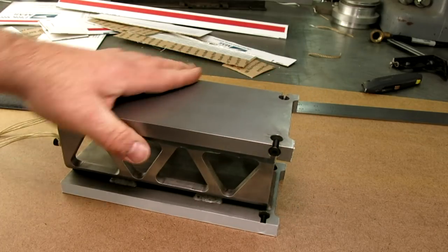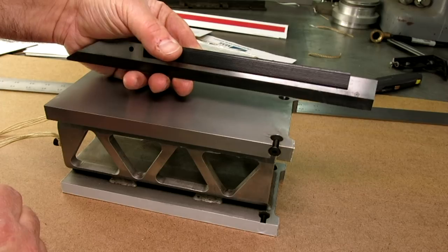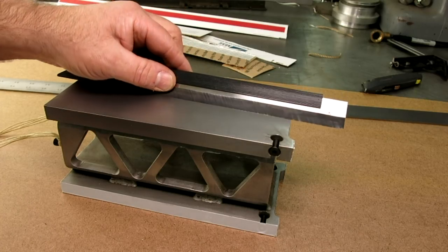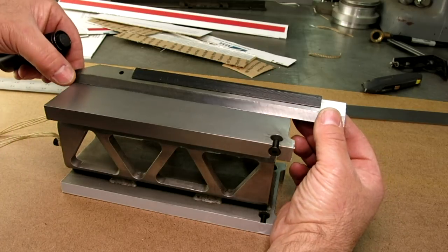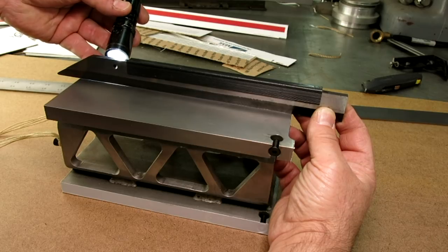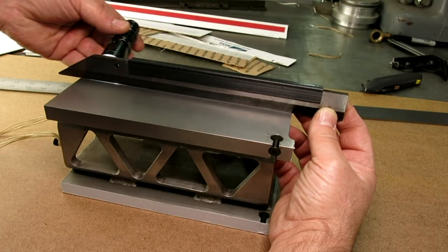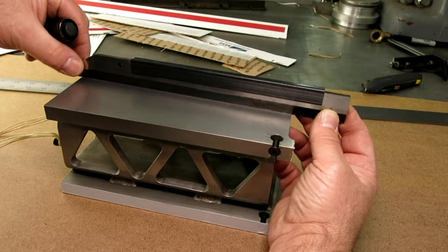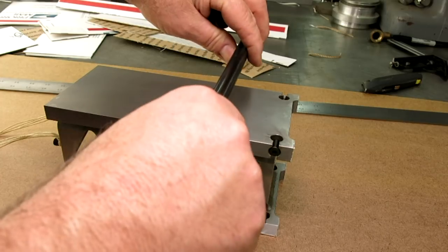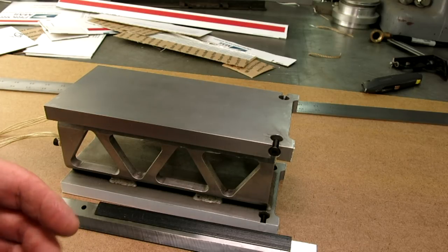The whole inside of this will be painted, and the contrast will be precision ground steel. What we're going to do — I have here a precision toolmaker straight edge. We can just lay that on the surface, and if there's a strong light behind it, let's see if it's coming through. You can see out at the ends there's a little bit of gap, but it's not significant — that's what's impressive. It's got some little wavies, but it's not bad at all. Pleasantly surprised how little I'm going to have to grind off of this. I got a nice deep case depth in case I had to grind a lot.